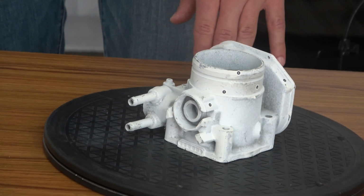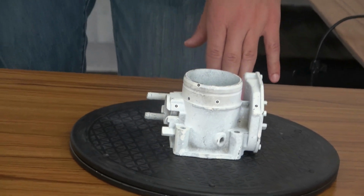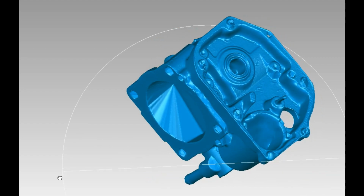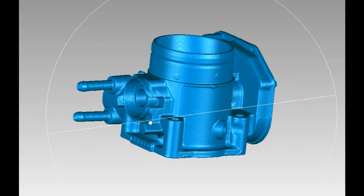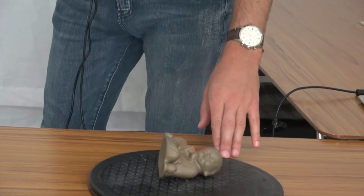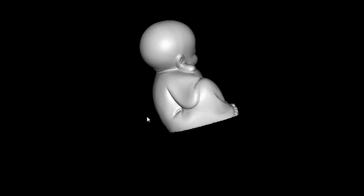Next comes the industry workpiece. Since it has many features, it's easy to scan and change positions during scanning. But be aware of your fingers. Once one of them is captured in an image, the real-time alignment will be disturbed and it will result in incorrect alignment. You can also do a group register, where it is easy to scan objects like this one.